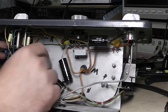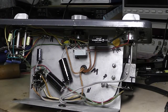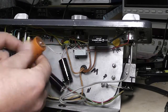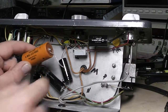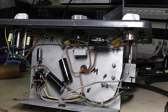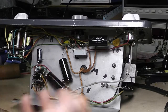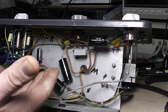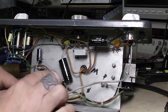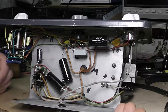You can see how much smaller that is. And then here — if you remember there was one across here — this was 8 microfarad at 525 volts. I don't have anything that high in voltage, so what I did was find two 16 microfarad capacitors and put them in series. Of course when you do that with capacitors it halves the capacitance, so it's exactly 8 microfarad. These are 475 volt apiece, so now it's 950 volts total — we're really good on that.